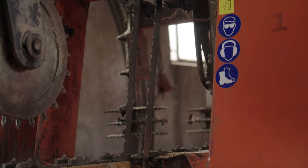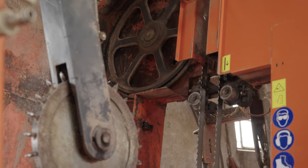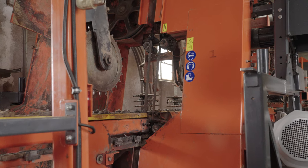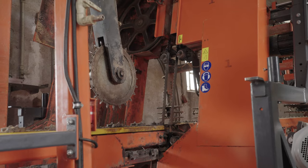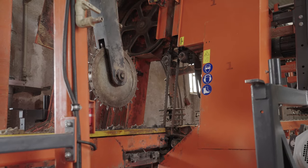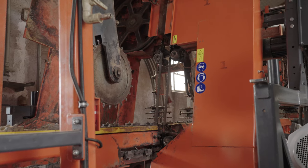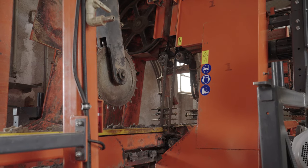That particular machine is equipped with blade wheels and a system for a standard 38 mm wide blade, which is 1.5 inch. But there is also a physical possibility to adopt our new system prepared to support a 2-inch blade. The important information, I think, is that even on an existing TVS heavy duty, there is a physical possibility to replace the wheels and switch to a 2-inch blade system.